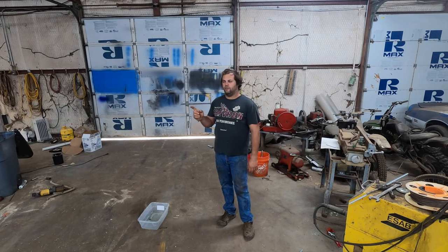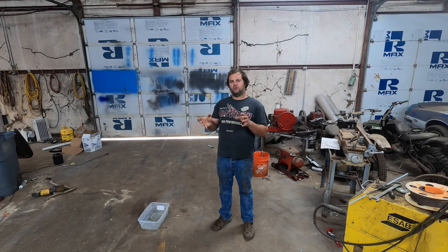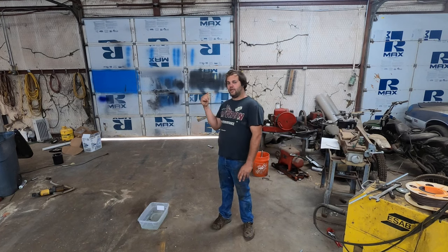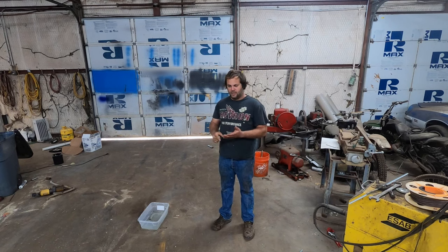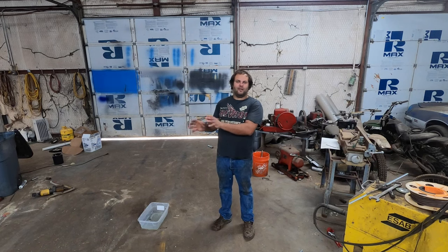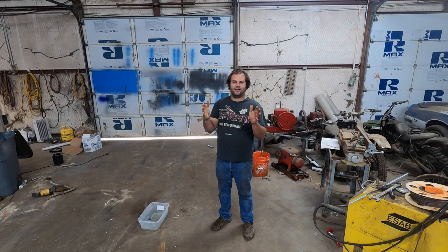Now, out there, one of them's on like a 600. One of them was on like 1,050. And one of them was on this well we're fixing to set this on, like 1,600. And they were all rod heavy. None of them had enough weights. The 600 didn't have any weights, and the one that came off the 600 is going on the deepest well. I took the one that was on the 1050 and put it on the 600, and then I took the one that was on that 1500 or 1600, the deepest one, and put it on that 1050. So they were both weighted about correctly, but now I've got this one, and it needs about 1,000 pounds of weight on it, and it didn't have any.